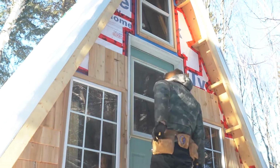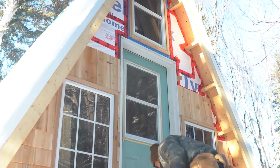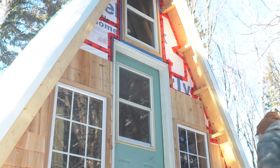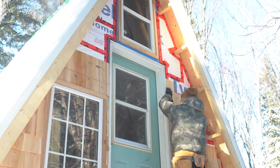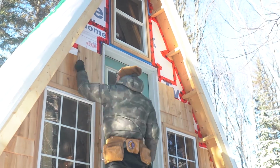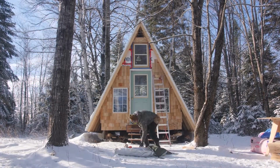I would give it an overhang of about 5.5 inches. I would take my chalk line, chalk it down, row after row, chalk lining that 5.5 inches up, throwing down another set of shakes. Again, with the gaps, we would ensure that the gaps were at least 1 inch apart, going up row by row.